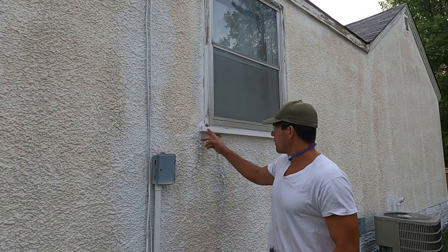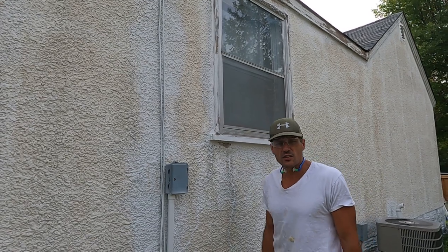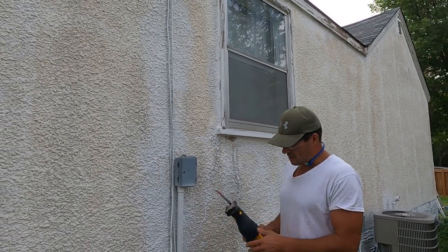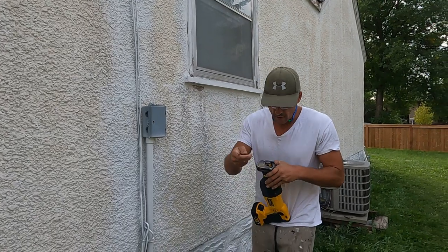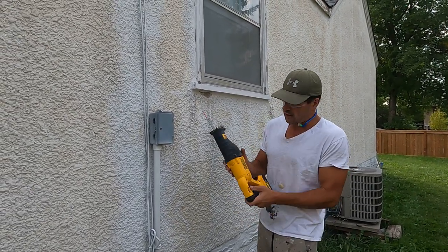These windows have a little bump-out on the end, so I want to cut it out now and fix and replace the stucco so that it's ready when we put the next window in, in a couple months. Here's a little trick: if you've got your reciprocating saw and you've got to do a sort of a tight cut, flip your blade out and put it in the other way, and then you can get a little flatter of a cut.